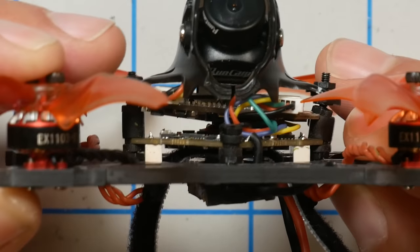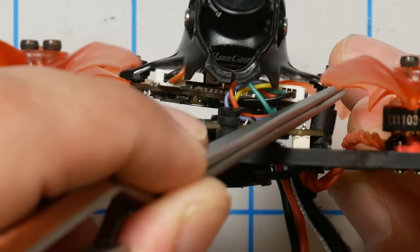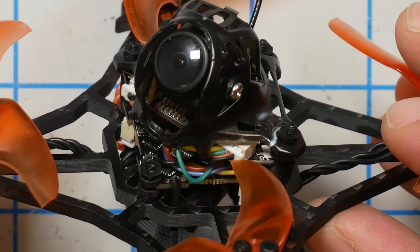In my case the quad remained flyable with no permanent damage, but you could certainly imagine a scenario where these boards would make contact, short out, and be damaged. After the crash I wasn't really able to just pick the quad up — well, I was able to keep flying it, but it's certainly not in ideal condition. I think Happy Model has done the right thing by trying to soft-mount the boards, but I'm not sure why you'd soft-mount the video transmitter. If the video transmitter had mounting holes and was hard-mounted to the mounting screws, it might actually provide more structural integrity, because right now the only thing holding this together is the plastic canopy, and it's just not providing enough rigidity.